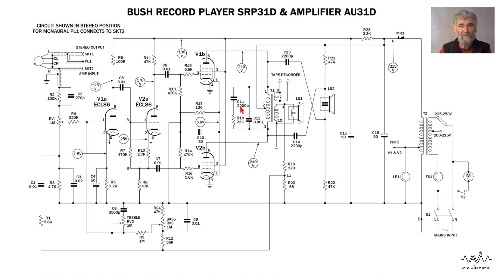There is a tone correction capacitor across the output transformer winding because it's being driven by pentodes, and there is further tone compensation in the form of a 2200 pF capacitor and 22k resistor, which may also have to do with maintaining stability.